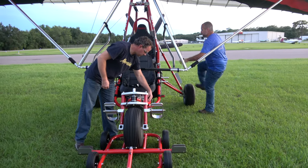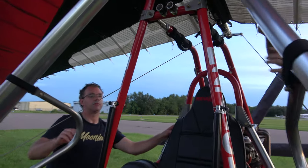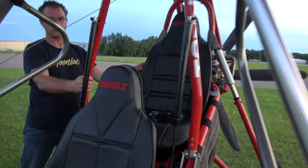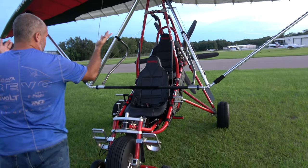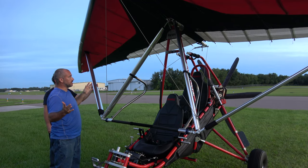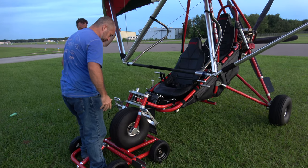I'm going to climb back up and pull our two speed pins. What's really cool about the geometry on this is — notice the pins are out right here, but the wing's not falling down. The mass is over center, which means that gravity is keeping it up. If the wind comes or something like that, my gas charge shock is engaged and my mast is now over center.